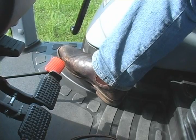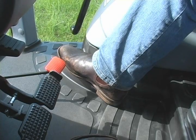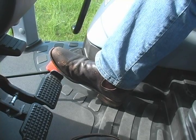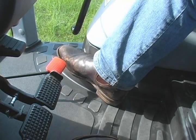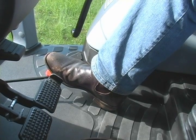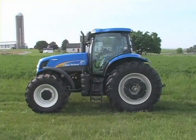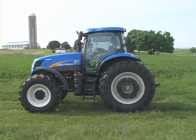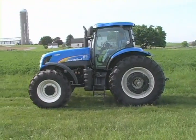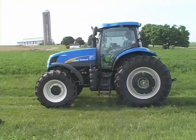The second way to control the tractor's speed is with the foot pedal on the floor. Not only does the foot pedal control the engine speed, it also controls the transmission ratio. To get the tractor to move forward, simply press down on the pedal. As you let off the foot pedal, the tractor comes to a stop. The further you push down, the faster the tractor will continue to move.